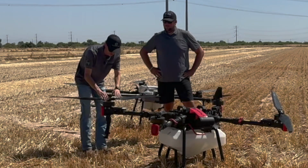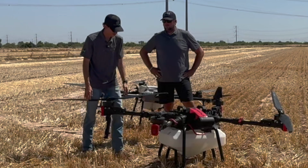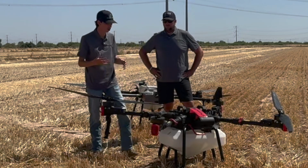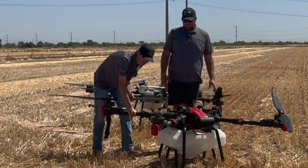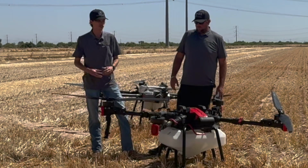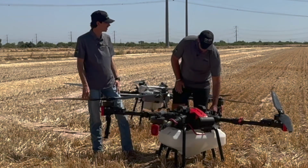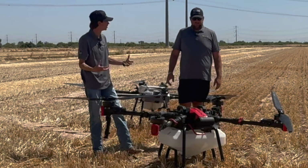Okay, I guess we'll just go over it too. We can add this at the front, but just like the T50, we're going to want to run down the arm, make sure, like Brett said, that the arm is latched because there is no alert on the controller to let you know. Check all those and then physically run your hand down. Make sure that you can't feel any bends in the metal. The T50 is going to have the carbon fiber arms. And this is aircraft aluminum on these. And these are going to be aircraft aluminum, so I would assume they show dents pretty easily. They show cracks and marks because it'll break through that even though it is stronger.